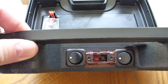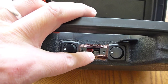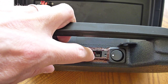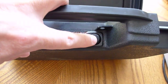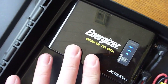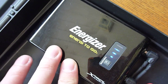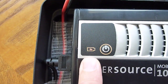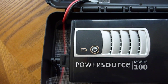On the front I've got two switches with an Anderson power pole connector — I use Anderson power poles for most of my kits — so I can plug in my radio or any other devices. This one is the 9-to-12-volt output, and I'm going to add another output for laptops. Then there are two switches: one to enable the panels to charge this lithium power pack — which is almost topped up at the moment, it takes about a day of sunlight to charge — and I can switch in and charge the second power pack, or switch it off, so I can charge one at a time.